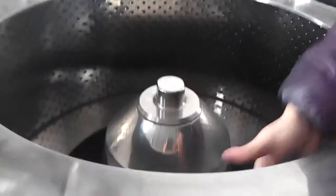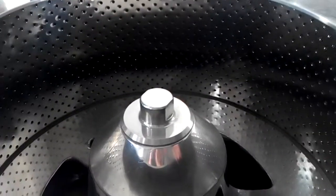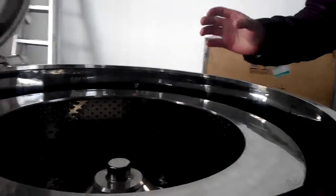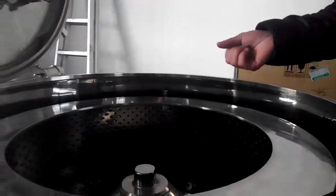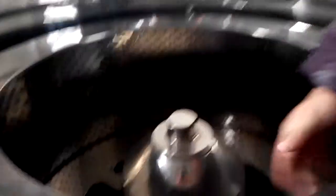As you can see, there are a lot of holes on this wall — it's sort of like the spin of a washing machine. But as you can see, the holes on the wall are very big. For small size particles, we must put a filter cloth to filter in the small size solid, like coal dust and salt or anything else. So when the centrifuge is rotating, the solid remains on the inner side, but the water goes outside and is discharged out.